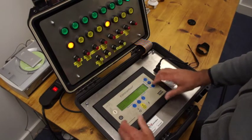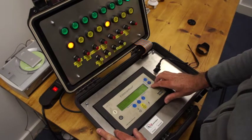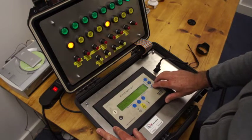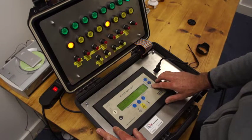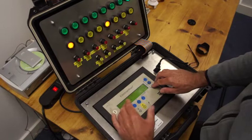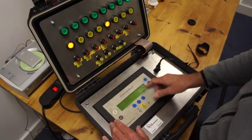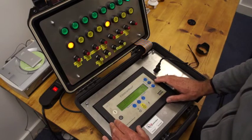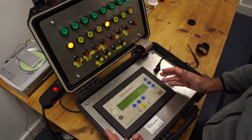Element 2 outlet I've set at 160°C, again absolutely fine. Then you've got compressor water temperature inlet and outlet. Going on, you have emergency stop closed/open, remote start/stop, remote load/unload open — we can go through that. Basically if this was an MD dryer model it would have all the MD measurements in measured data. It's quite simple. Now we want to get back to the main screen.